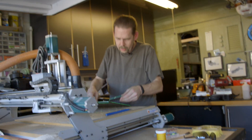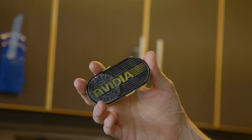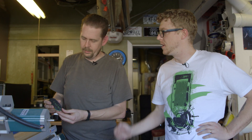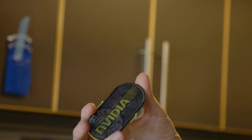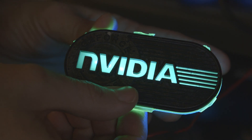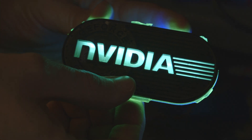There we go. Not bad. Sweet! That thing looks awesome. This is what it looks like right out of the machine. Now what's the next step to clean it up? Just a little hand finishing — cut off a couple more pieces that didn't cut out, hand sand it a bit to remove some of the tooling marks, and buff off all the leftover tabs.